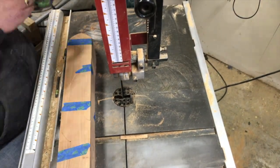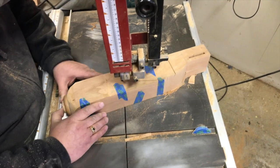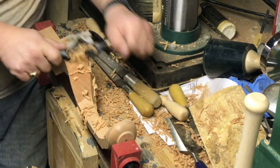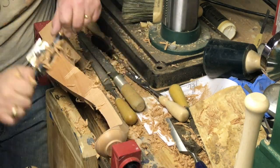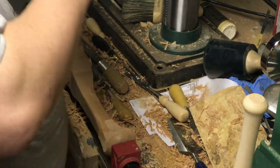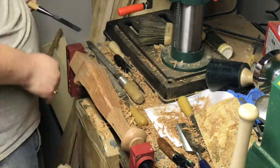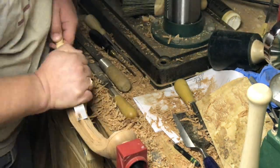I taped the offcuts back onto the board so that I could cut out the opposite side. Once the cuts were done, I removed all of the waste and now you have a rough cabriole leg. This is where the real work in making a cabriole leg comes in — you have to clean up all the bandsaw marks and smooth out the surface with a spokeshave, then mark out some lines to guide yourself to produce even curves from one face to the other. You basically start with a four-sided leg, turn it into something of an octagon, and then make it a continuous curve from one face to the next, using chisels, rasps, a spokeshave, finishing with a card scraper and then a sander.